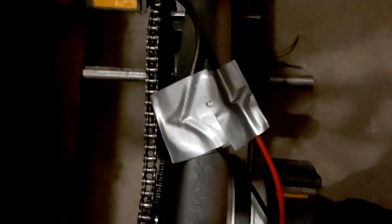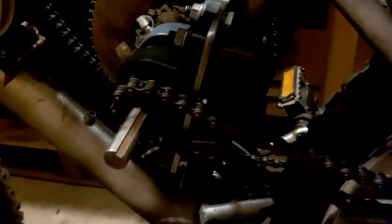After the little test, I noticed the mount for the jackshaft did get twisted a little bit from the torque. I straightened it out and tightened the muffler clamps, and it's straight again now. In the future I may need to weld it right there once I know it's going to stay in this spot. For now I'll go ahead and shorten up the shaft with the angle grinder and then put in the keys and set screws.